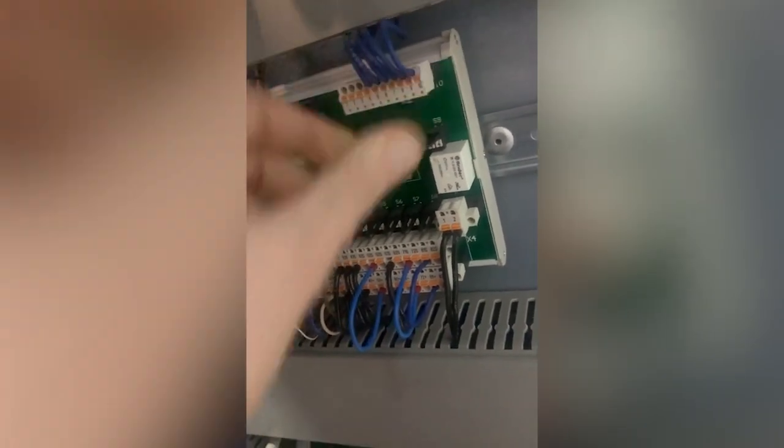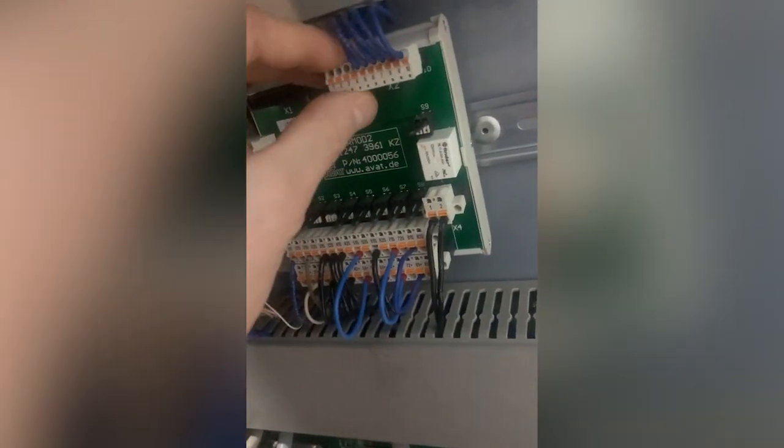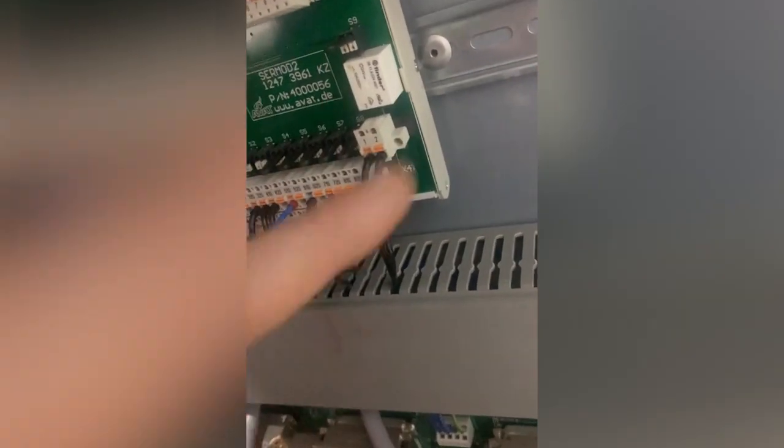That's operator relay. It's not this one. It's a relay I can't see, so I'm just going to go and get a screwdriver, take this end plate off and just see what's going on behind here. There might be a big mark on this, but I suspect my problem lies here still, and that's proving that more, and then we'll bell these through.